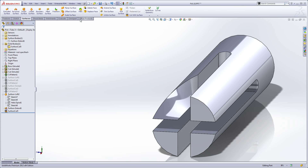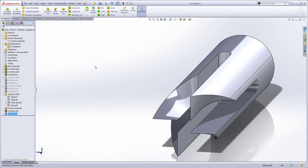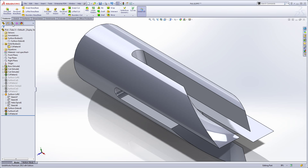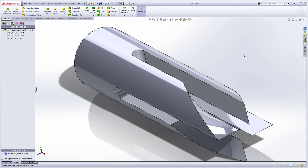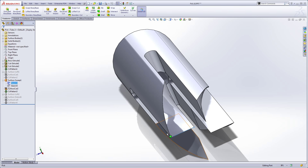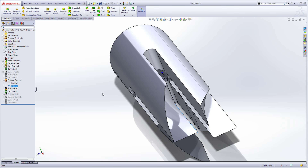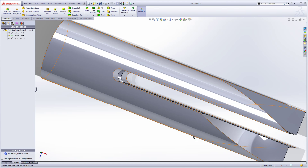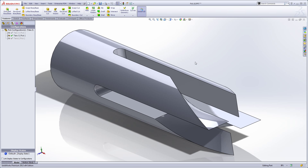We can turn the surface off, and of course do our circular feature array — circular pattern about the center of that circular face, and hit OK. So some really nice ways to get a couple different pieces of geometry. The first one used the 3D sketch — a little bit more complex. Take two was the easiest and most simple, only requiring two sketches: a single line sketch and the line for the path, though with less control over the result. The last one used the actual helix itself, giving a smoother contour, more control in the dialog boxes, and we added equations and dimensions to drive it precisely. Hopefully you enjoyed that — thanks for watching.